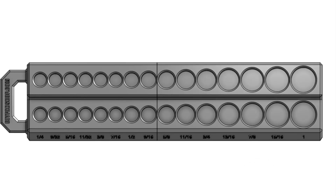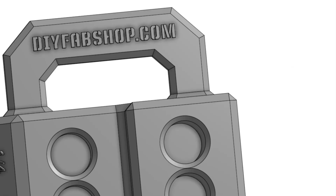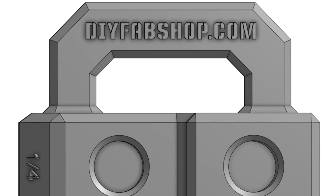The general form and layout of the rack should look familiar — it's like many commercial products that use a two-row rack. I personally like to have my deep well sockets right behind the standard version. Socket size labels are placed across the angled front face to balance readability from the front and from the top. The lettering is raised, and I've been using the multi-material capability of my Bambu X1 printer to print the raised labels in red for better readability. I also added a handle to many of the racks — both with and without handle versions are available on my website. Handles serve as a visual reminder of portability and provide a finger purchase area for peeling the rack off a metal surface, since the magnets that hold the sockets also secure the rack to metal.